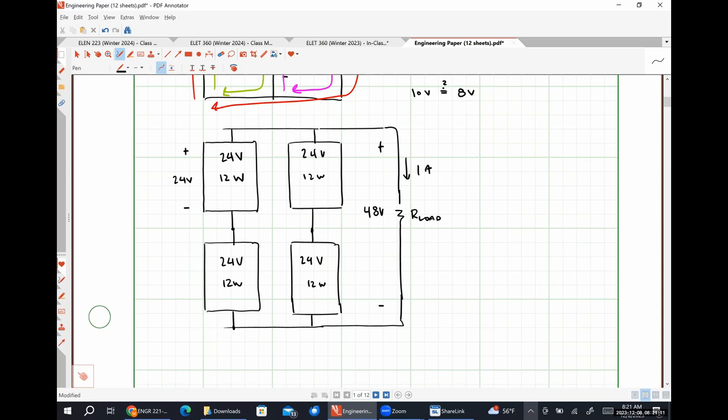So in those systems, our battery energy storage system is literally just a rack full of batteries, and then we wire several racks in parallel so that we're running at a voltage of about 1500 volts, but a current of about 4000 amps, so that we can feed the grid when electricity is expensive off of this battery's energy storage system, and then recharge things during the day when power is relatively cheap. Yeah, or when the sun's out and we can just let everything run off of the grid when power is relatively cheap. So anyway, there are a lot of industrial applications for connecting effectively voltage sources in parallel.